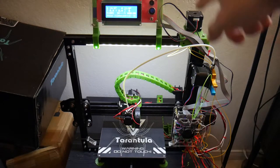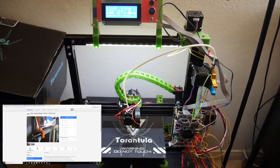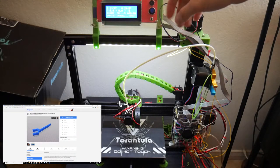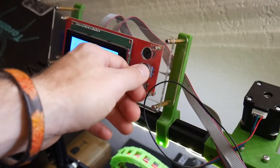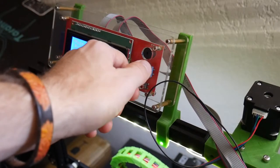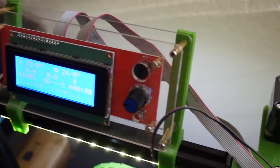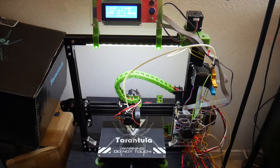As you can see at the very top, we have these little green clamps for the LCD screen, and I think that's almost a must for this printer. By default, this printer doesn't actually mount to anything — the LCD screen is just loose. For me, that's just something that's going to fall off and break. So that was the first upgrade. They added the ability to add screws if you want to lock it into place, but the tolerance is so tight that you don't need any additional hardware — you just undo the long LCD screws, attach it, and it snaps right into place. I strongly recommend this upgrade.